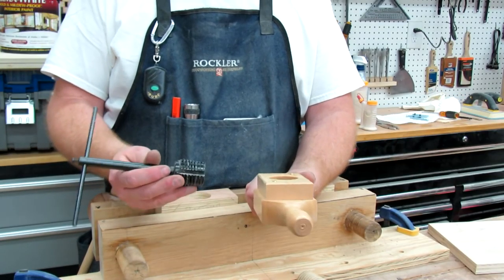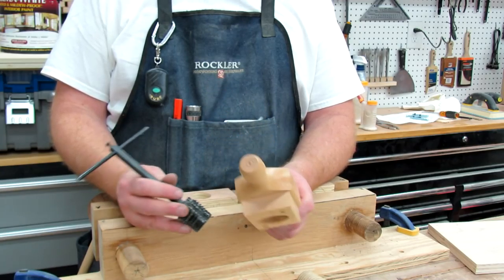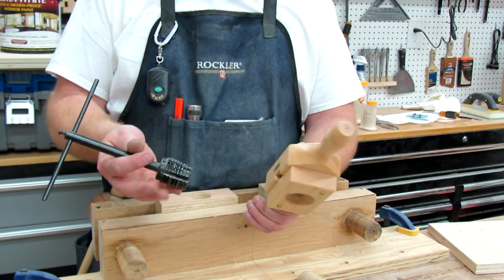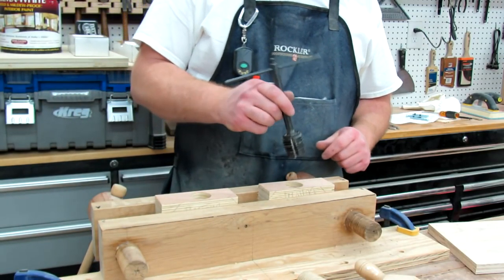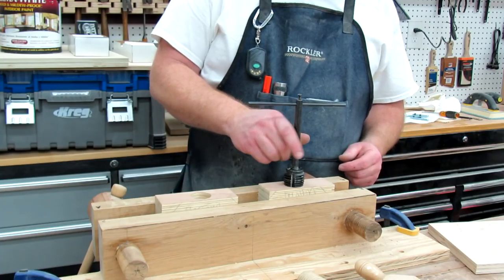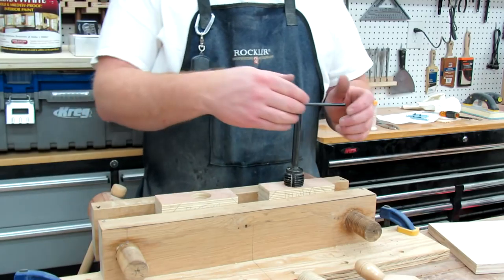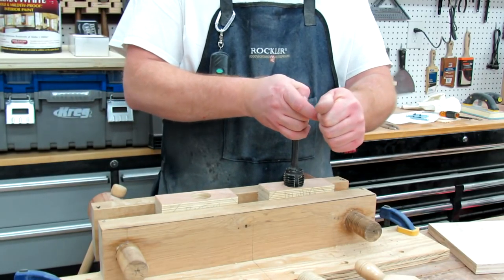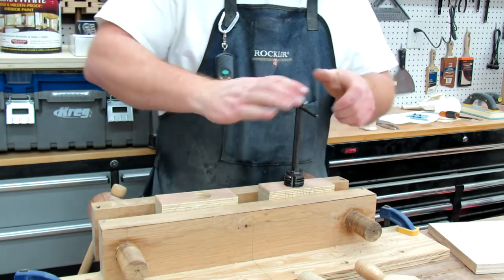This kit is pretty much set right out of the box. If you do a lot of it you may have to sharpen a bit, but so far I haven't had to sharpen anything. What's really nice is because of how well it's made, that inch-and-three-eighths hole literally drops in and self-squares the tap for me. And now I can just go right down with just a little bit of downward pressure and start cutting the threads.